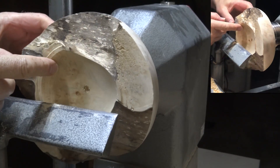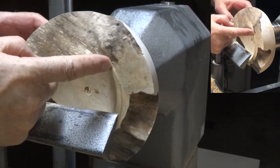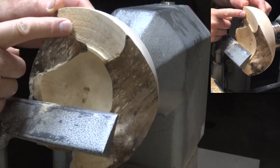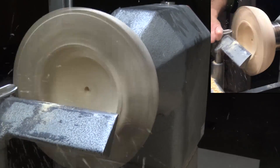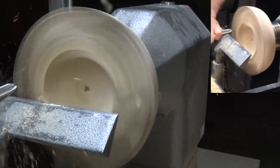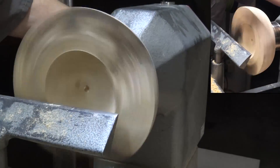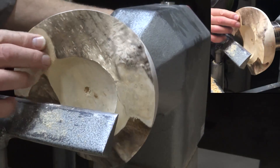In order to try to get less vibration when I hit these open areas where I'm cutting air, I've increased the speed to 2,000 RPM, and I'm also hoping that will let me clean this up. This is very, very chipped. It's better, but still lots of sanding going on in this area.